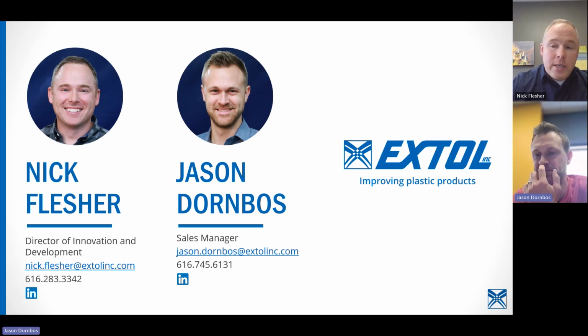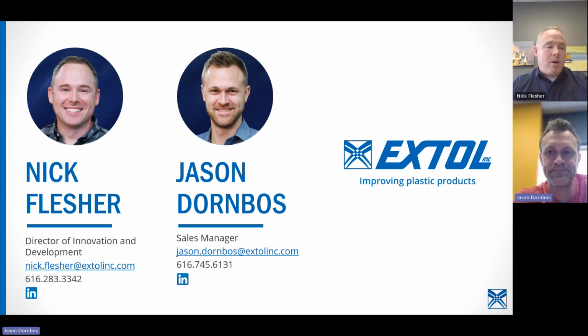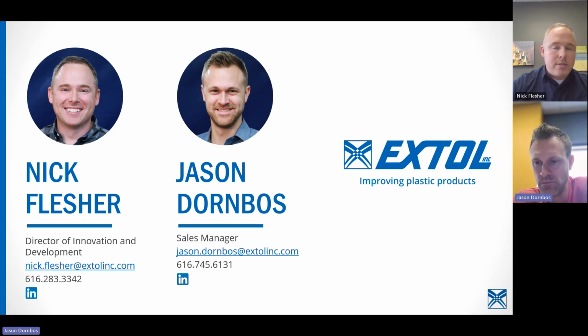There absolutely are lasers to do that. They're very different wavelengths. The 2 wavelengths we've mentioned are specific to getting plastic hot, to melting plastic. So I don't think it's a situation where you could use the same laser to weld the PMMA and then clean it. You would definitely need to use a different wavelength. They're kind of doing different things.